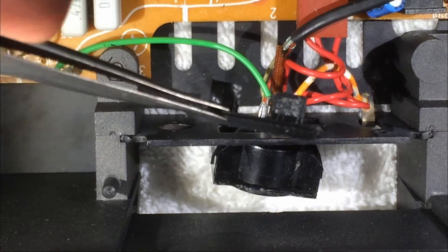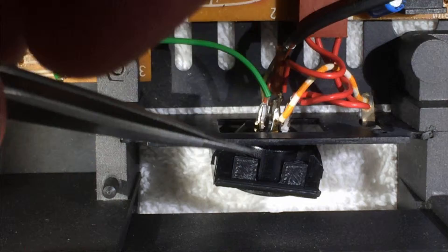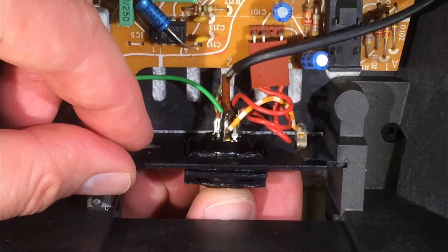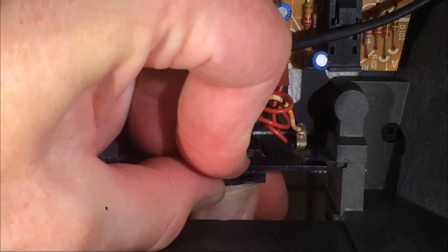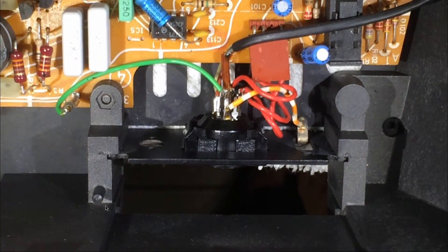I put one insert on top here, and of course a second one needs to go on the other side of this jack. The next step is to push the jack back in so that these tabs that hold it from the back side go through again. This takes a little bit of force — I simply squeeze it as hard as I can. You hear it click in, and it makes a very solid press fit.